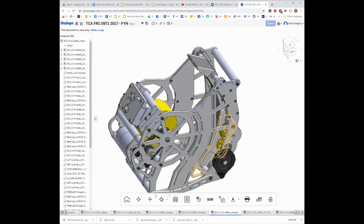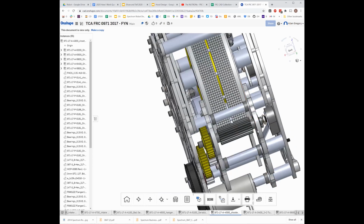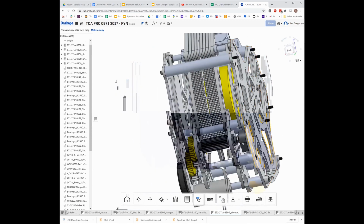That type of situation. Does that make sense what this is doing? Yes. This is an encoder, so they have an idea of where the hood is, because that's one of the issues we have: how do we make sure we know the position of the hood? Do we have some way, either an encoder and some way to home it? Is there a potentiometer or something?